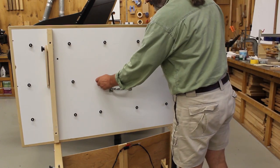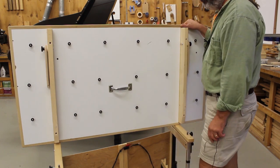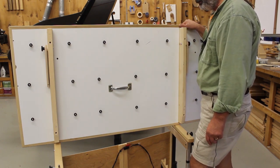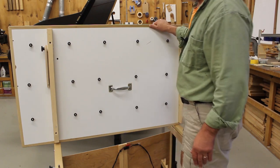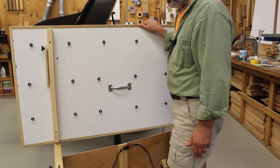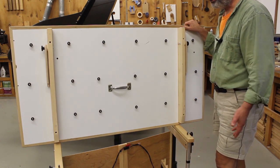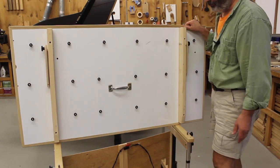So the dip regulating or the elevating screws here are just located throughout the bottom of the action frame, on the rails of the action frame. And you can reproduce dip with precision, either in one section or in the entire piano at once. Yeah, you do have to use technique, but it can be done, and it's not hard to learn. It didn't take more than 5 minutes to set the dip on this kind of a table. The aircraft aluminum has these beams, and the combination of the aircraft aluminum and the beams makes this pretty darn stiff. It does have some flex, and that's okay, as long as your technique is such that you can accommodate the flex, and I can show you how to do that.